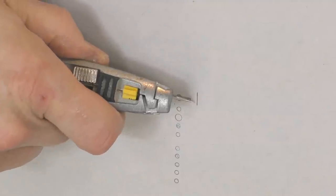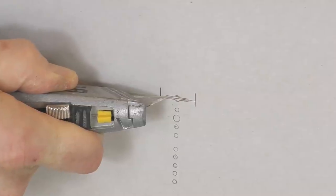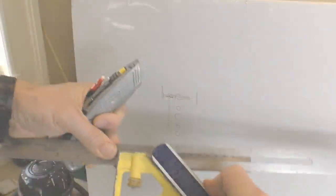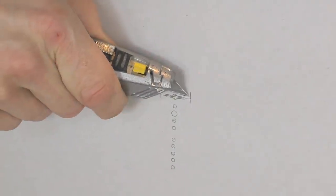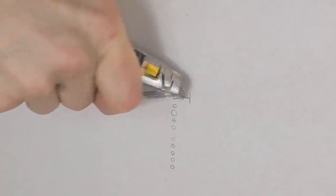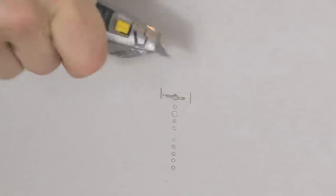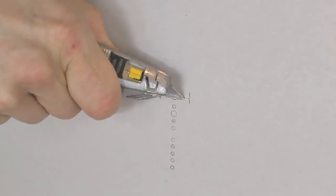All we need to do is make a little horizontal cut in the plasterboard and then at a 45-degree angle. You could do this accurately using a combination square and a sliding bevel, but to be honest it's just as easy to do it by eye. I'm going to cut into the plasterboard at a 45-degree angle, just to get the Blade Fixer going in a minute.